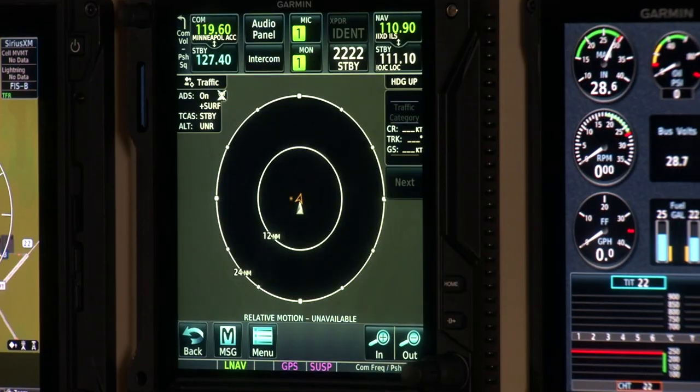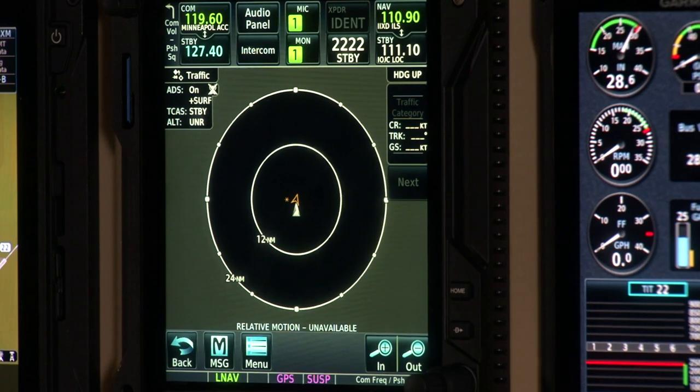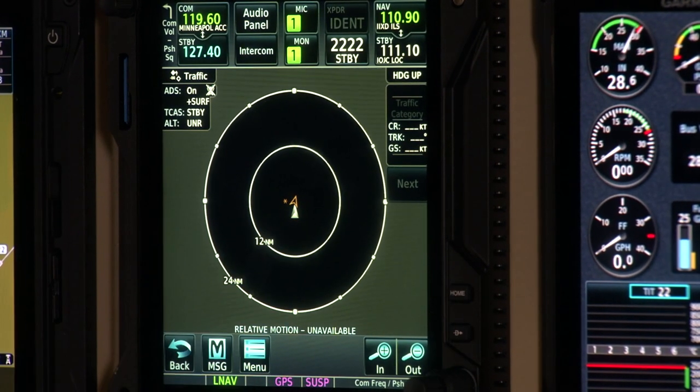On the traffic page, one of the nice things about the Garmin ADS-B solution is what's called Target Trend. It uses both your relative motion and the target aircraft's relative motion to show how you're moving in relation to each other — a step above a typical ADS-B solution that only shows how the target is moving. Also, aircraft on the ground are shown in brown, giving you a quick visual indication that they are not airborne, which is very helpful when overflying an airport.